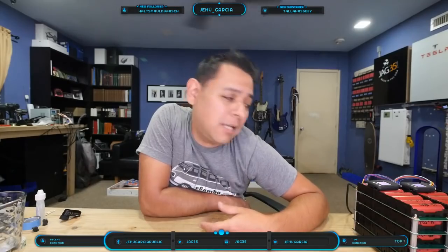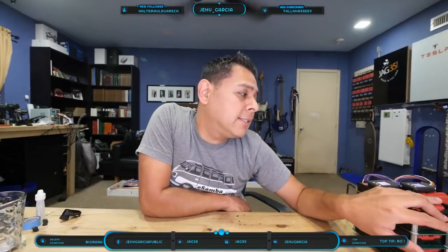No, the CID will not protect the battery if it has been reset. Yeah, so if you do that, then that's it. You won't be able to work it out. But I just want to see if those cells have any usable capacity. You know, because the CID is basically a fuse, right? And oh, here is the other cool thing.